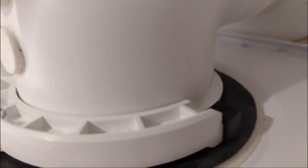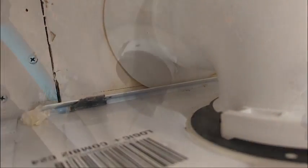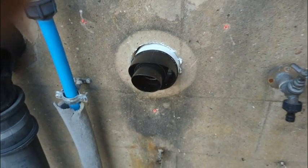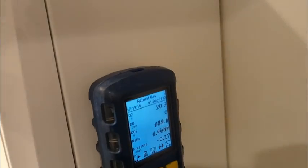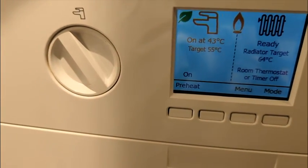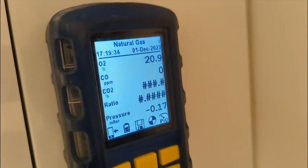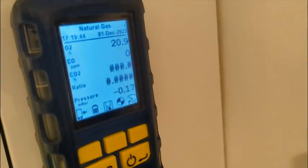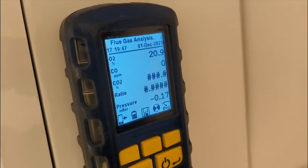All nicely locked back in, screw tightened up. Come outside, push that in, make sure it's fully engaged, twist it into the right position, and let's go and do a flue integrity test. Before cementing or securing the flue I want to make sure this flue is correct and it wasn't anything to do with the boiler itself. We're not getting anything - that's what you'd expect from most boilers, and especially a one-year-old boiler that's only just been recently installed.